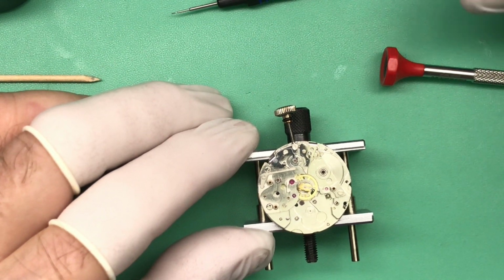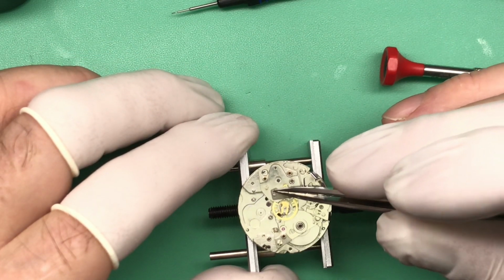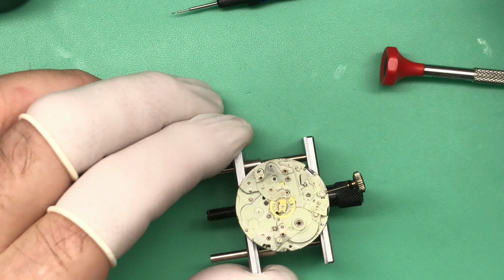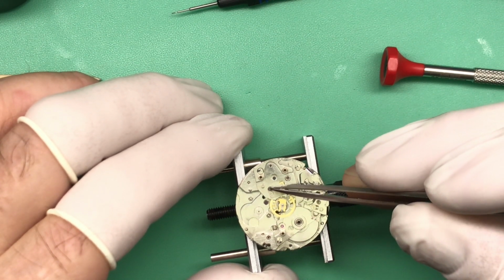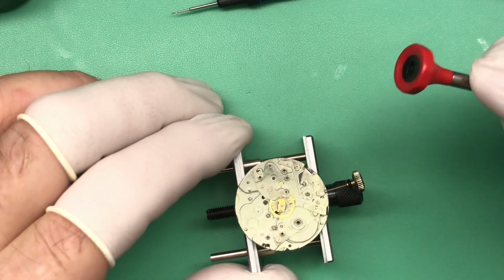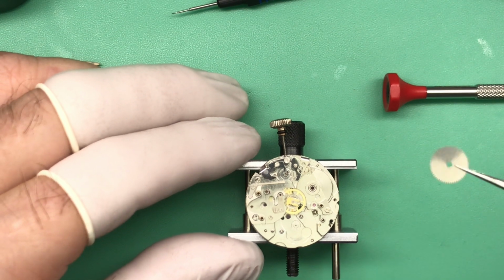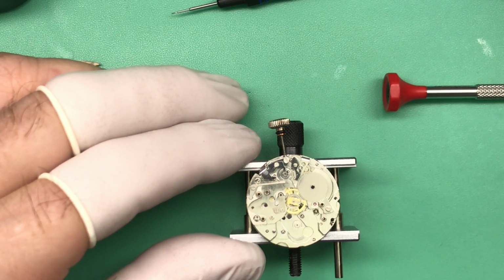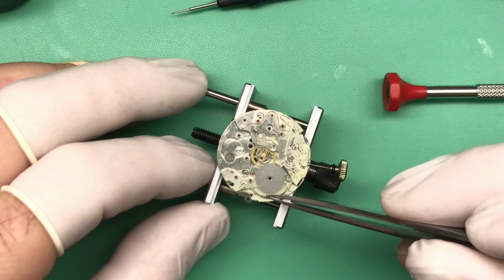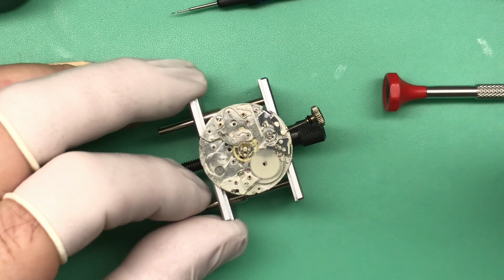Now we can build out the rest. It's a very stepwise process here, and lots of layers in these chronographs. Just like with any watch with complications, things will be stacked and interleaved, and it's just the way they roll. Let's go ahead and get your ratchet wheel installed. We should probably put your click on too. Doesn't have much purpose without a click. That's important.